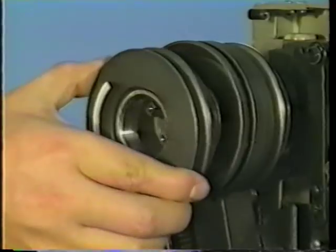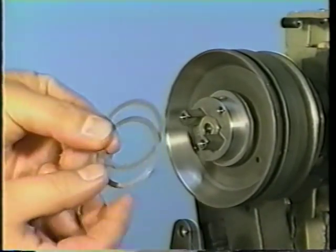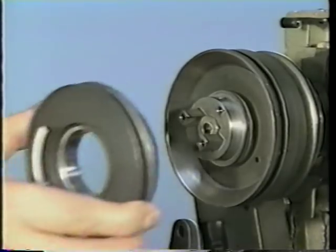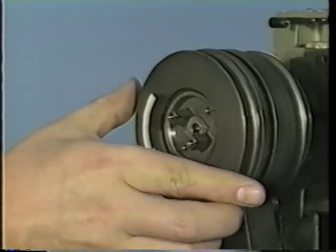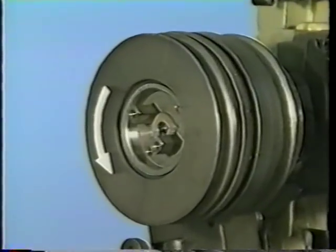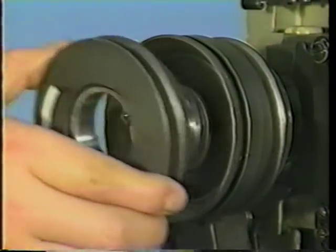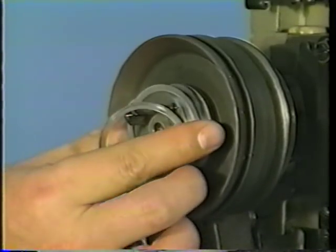The overall clearance in the low-speed pulley, high-speed pulley, and changeover pulley is 0.7 millimeter. Adjust the clearance properly by changing the number of adjusting shims to be attached. Increasing the number of adjusting shims O will move the low-speed pulley towards you. This means the overall clearance will be widened. Decreasing the number of adjusting shims will narrow the clearance.